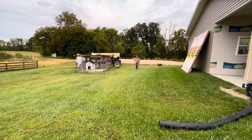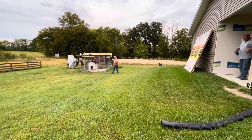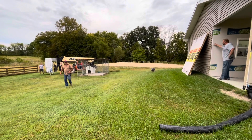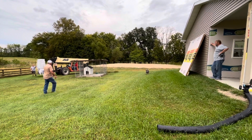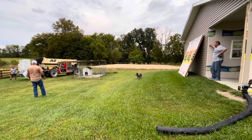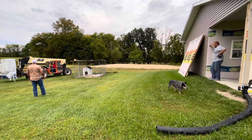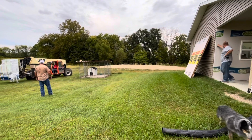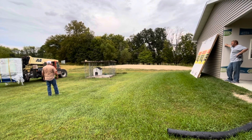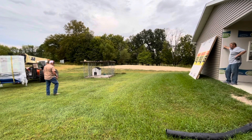This compressor is all set up with all that. Now, there are situations where if you're cutting very, very thin material — say like 22 gauge and thinner — you could possibly, if you get enough clean air, use a typical 25 CFM compressor at somewhere around 175 PSI. I've seen a few guys do that, but it really limits you in what you can do. You really need to think about getting a bigger machine like the one you're seeing in this video.